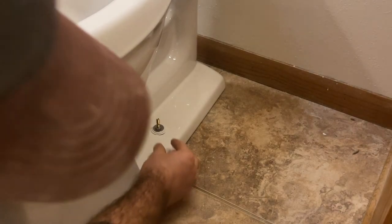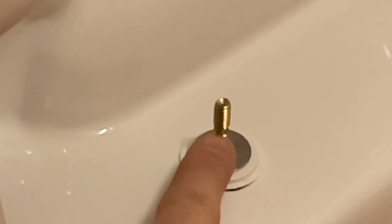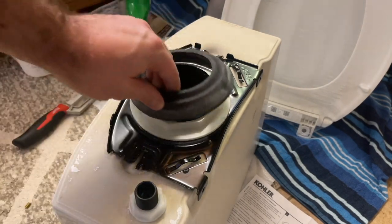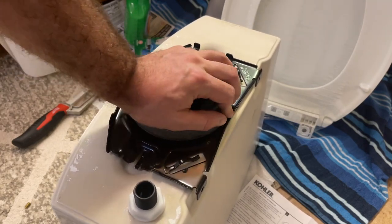No wobbles, no movement — that's down tight. As you can see, this cap is not going to fit on here. There's just a little groove and that's where you're going to cut using your hacksaw. That should just snap. Now it comes with a little ring and we are going to put that directly on here — that's going to help create a seal when we put the tank on the actual toilet.